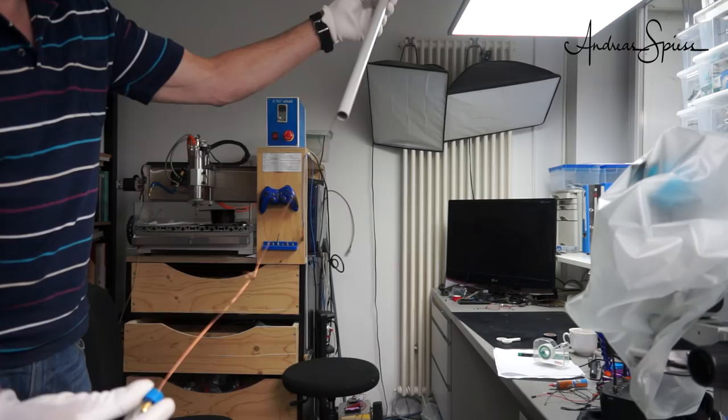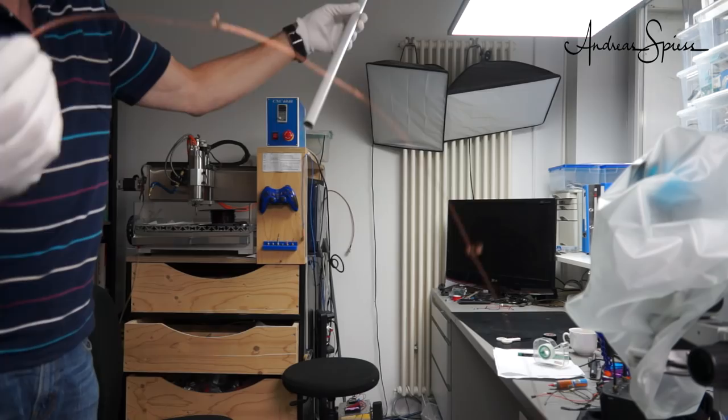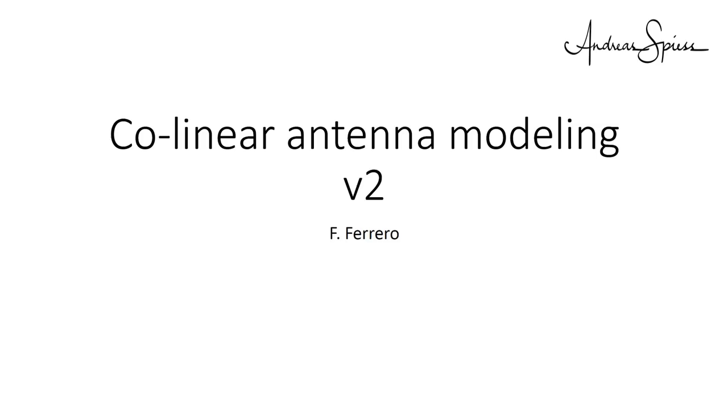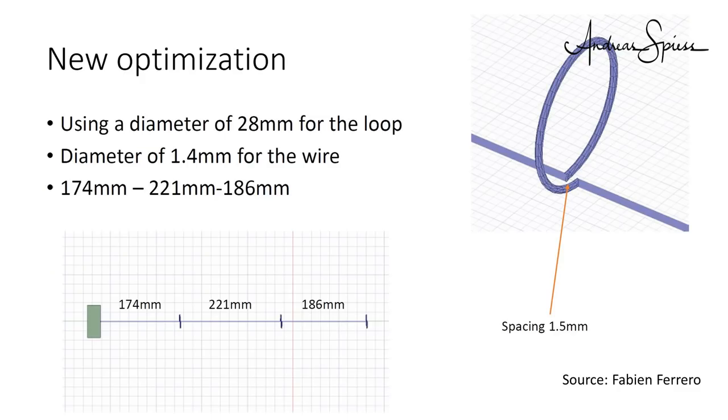This is very convenient because copper wires are not very stable and this antenna is quite long. Then Richard from the UK sent me a new design for a collinear antenna which was made by Fabien, a French professor who has all the knowledge and the tools to create all sorts of antennas. So today I tried to build one according to his plan. It is shorter than the first one, but its loops have a bigger diameter and the wire diameter should be 1.4 mm. So I cannot use the 20 mm PVC pipes anymore.